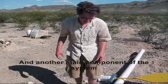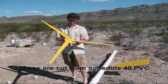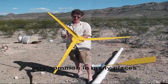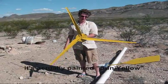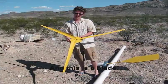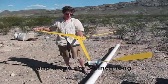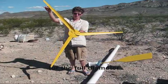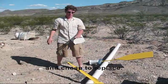Another main component of the system is, of course, the blades. That's schedule 40 PVC, available online and many other places. Painted for UV resistance so you can actually see them. This is a sort of blade, like a tile saw blade, drilled on the hub. These are 30 inches long, so it's a little over 60 inches for the full rotor diameter. These look pretty good — they're light and cheap to replace.